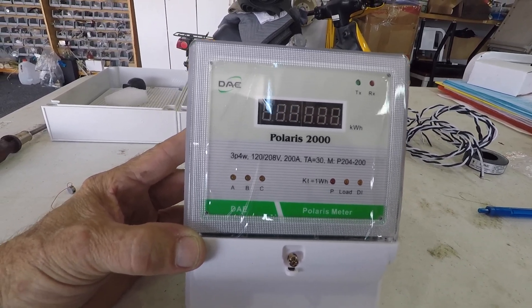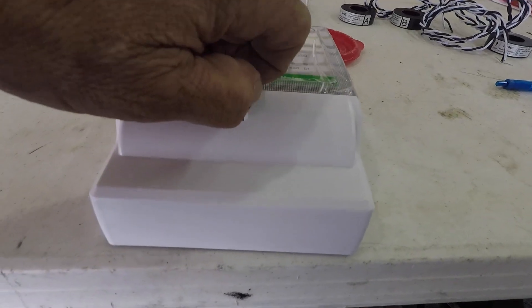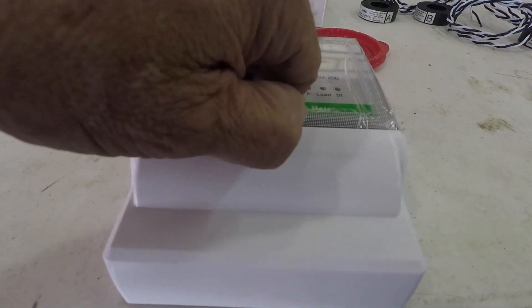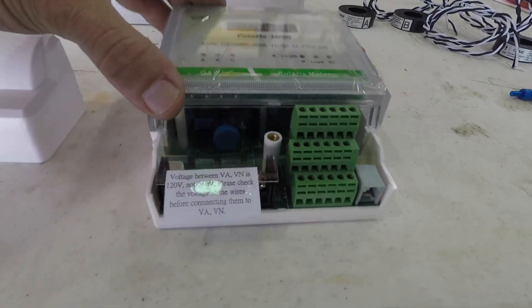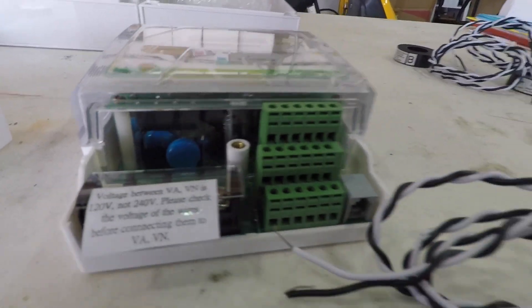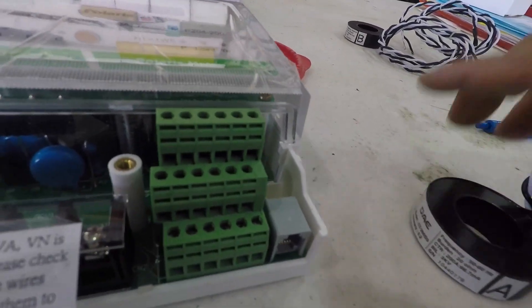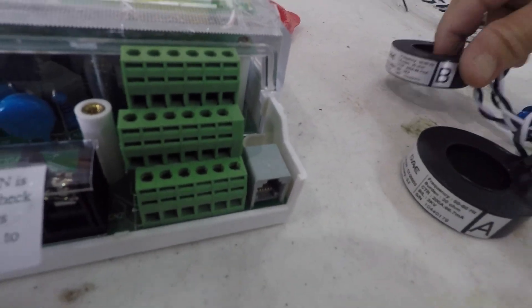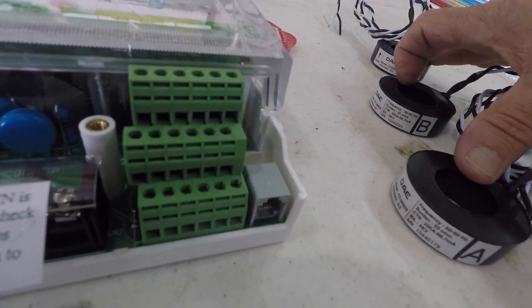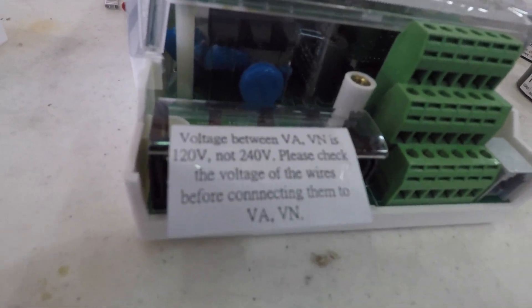Here's the outside of the meter. I'm taking off the cover plate on the bottom, and as you can see there's a connector — this is for hooking up to supply the power to this meter. And this is where the magnetic toroids go, so you can put one on line. As you can see from the meter, one goes on circuit A, one on circuit B, and one for the third. They go on the three main power lines for three-phase 220, and then these connectors get put into this block according to the wiring diagram. This is where they go for the main power.